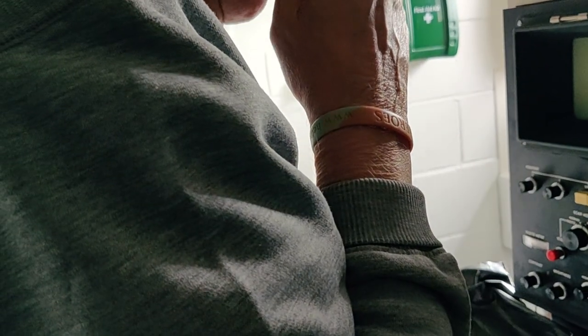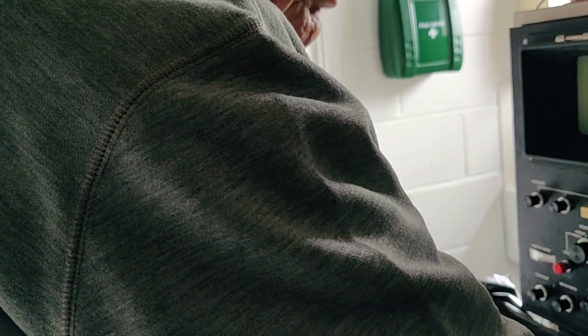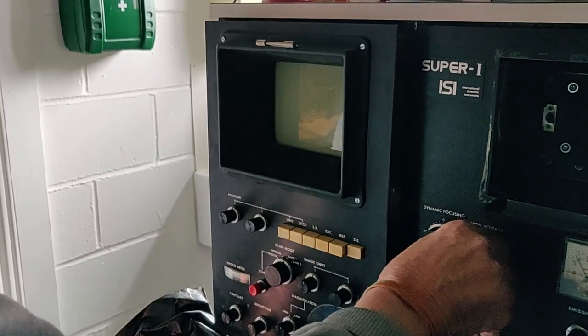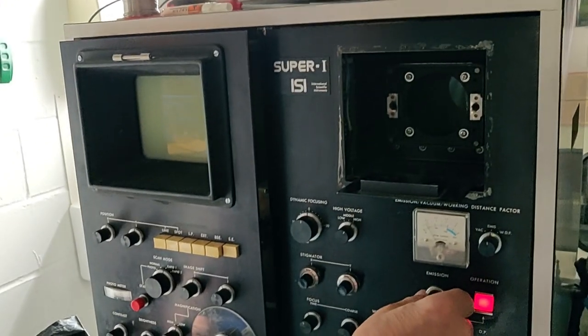That looks to me like a physical breakdown somewhere inside the gun. Like a spark? Yeah, like an arc of some description. Well, maybe the image. Yeah, look at that, actually. You get a white spot, by the way. The trouble is, I don't know whether there's things going on with relays, you see. Oh, I see. So it might just be cross-coupling or...